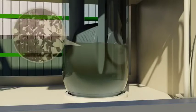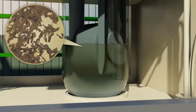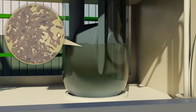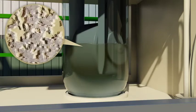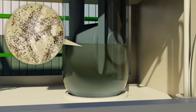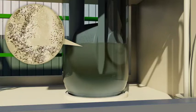The white crystals of silver chloride, which form a surface on the alloy, experience a rubbing effect due to axial rotation of the perforated basket at slow speed. Hence, these crystals separate out from the surface of the alloy and break up further to pass through the perforations of the rotating basket. This phenomenon leaves the alloy open for acid attack, which helps the advancement of the reaction.